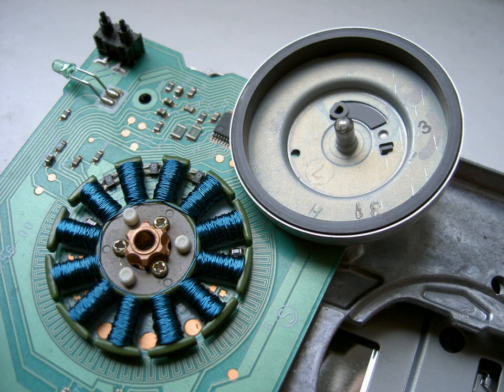The development of semiconductor electronics in the 1970s allowed the commutator and brushes to be eliminated in DC motors. In brushless DC motors, an electronic servo system replaces the mechanical commutator contacts. An electronic sensor detects the angle of the rotor and controls semiconductor switches such as transistors which switch current through the windings, either reversing the direction of the current, or in some motors turning it off, at the correct time each 180-degree shaft rotation so the electromagnets create a torque in one direction. The elimination of the sliding contact allows brushless motors to have less friction and longer life — their working life is only limited by the lifetime of their bearings.